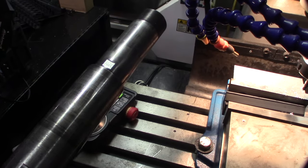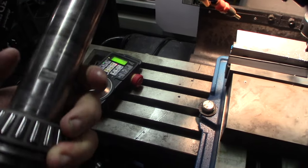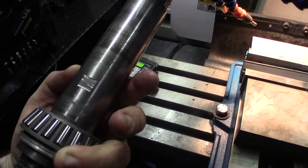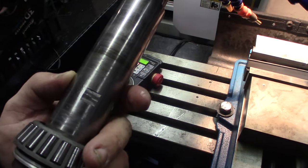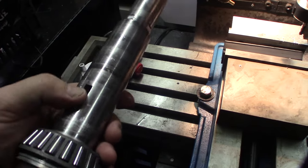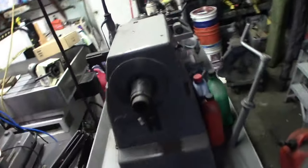Let me show you the flats - yeah there are a lot of witness marks, but hopefully that will keep the set screw recessed and not interfering with the slip fit. Here is the other one - because it has a set key it's never going to move position. I'm going to hook this up to my other lathe over there and polish it up. It's also CNC - I haven't fired this one up for a while.